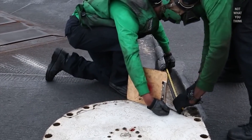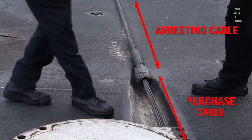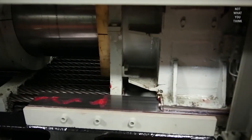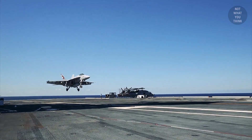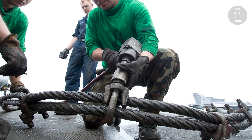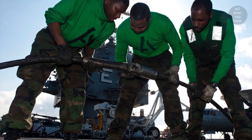The purchase cable is also a wire rope that looks very similar to the arresting cable, but serves a different purpose. One end of the purchase cable is attached to the arresting cable, and the other end is connected to the arresting gear engine. As the aircraft hooks on to the arresting cable and pulls it, the purchase cables are also pulled out — this is referred to as payout — which transfers the landing force of the aircraft to the arresting engine via the purchase cable. Purchase cables are much longer than arresting cables, and are not changed as often. They are usually checked monthly or every 300 arrestments for the first 1,000 arrestments, and after that, they need to be checked more frequently.